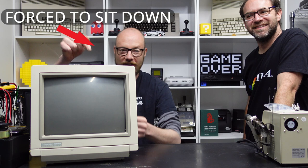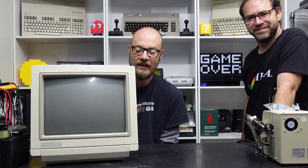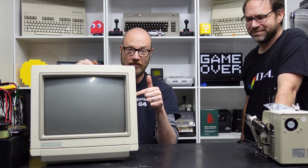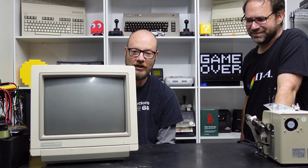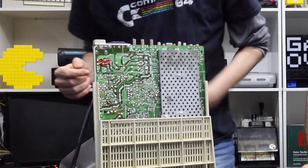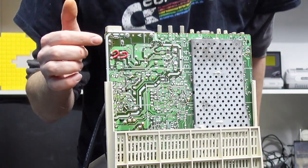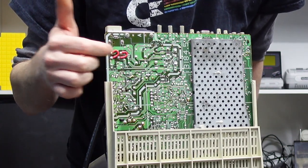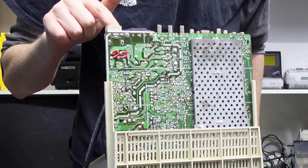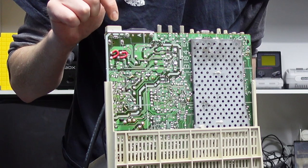G'day everyone. This is actually my 1084S and when Mark said hey do you need a switch, I went yep. Just like his monitor that's had a bit of a hack job, this actually isn't as much of a hack job, but this one has been hot wired. If we turn it around you should see a couple of red bodge wires just here, and they're basically creating the circuit for where the switch used to be. So what we're going to do is remove these two wires, also remove the metal bracketry that holds the switch in, then put the switch in, put the bracket back in, and in theory we should be good.